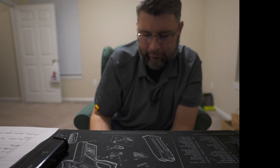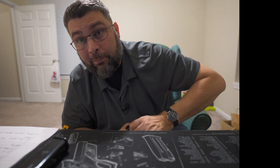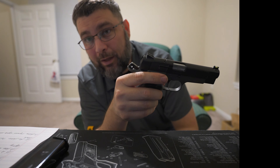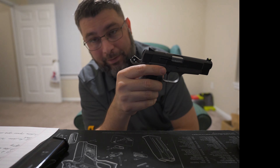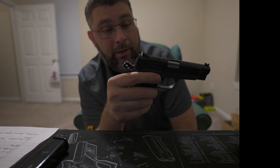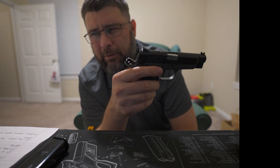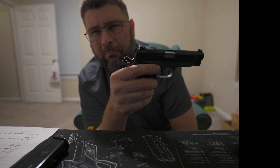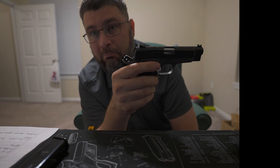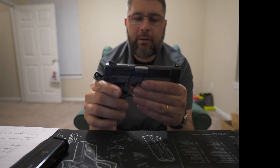I also had to make a shim to get the factory grips to work. The Mark III stock grips are exactly 3.002 inches — the opening inside the frame is exactly 3 inches, no more no less. That extra two thousandths is what helps it lock into the frame. When I replace these I'm going with a set of Navidrex micarta grips in the thin pattern, made exactly to the 3-inch spec. Even with actual Browning FN High Powers there are variances within the frame. This is a beautifully machined aluminum frame — I do believe it is a forged frame. I am well over 2,400 rounds through this gun so far.